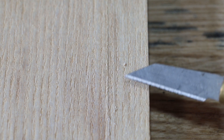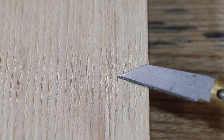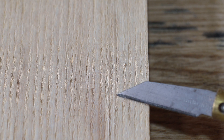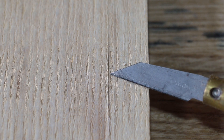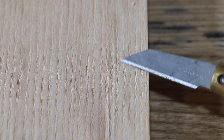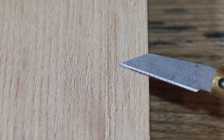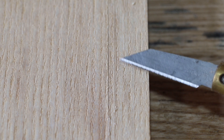Let's try a cutting gauge right next to that and see if we can get it to stay nice and straight. Tilt it back, light pressure. That's worked just fine. You can see that the line on the left is the marking gauge with the pin and the line on the right is the cutting gauge fitted with a knife. They've both stayed parallel along the entire board - the only difference being that the marking gauge line is a little bit easier to see right now, whereas the cutting gauge line blends in with the grain and is therefore quite difficult to follow. But there's no dispute that you can quite easily cut a parallel line in a coarse grain timber such as ash with a cutting gauge if you need to.